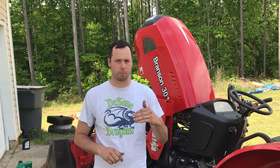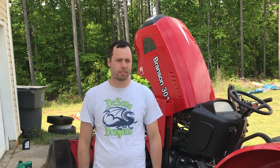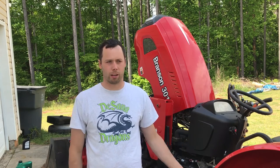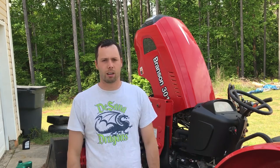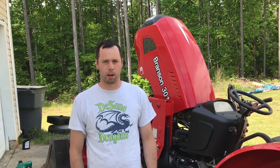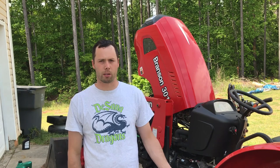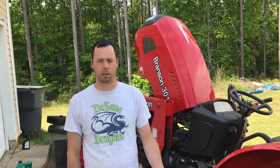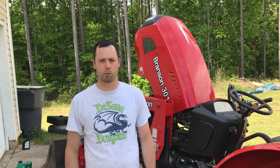When I was in mid range, it wasn't digging, but that was totally my fault. I looked down and threw it in low range, and then it would plow through everything and dig, and I was really impressed with the amount of loader work I was able to do after that. The grapple, as I suspected, worked really well for tearing the pile down, got all the stumps, and just broke it up really well.